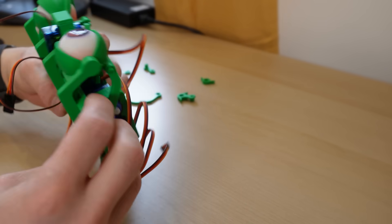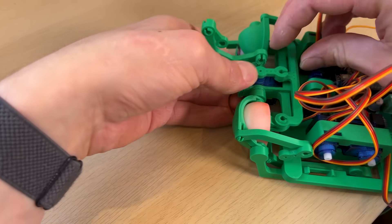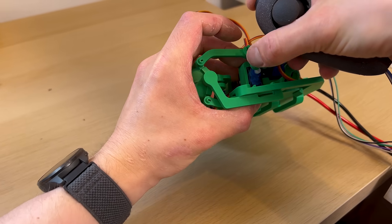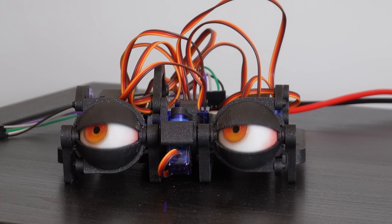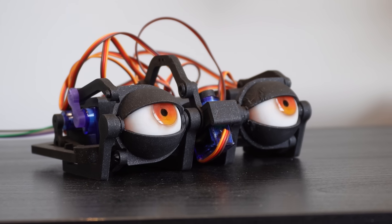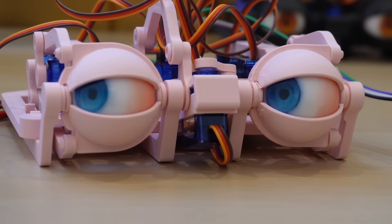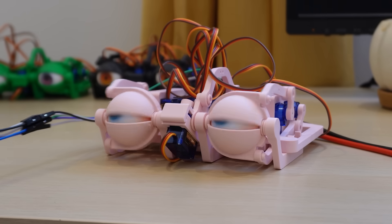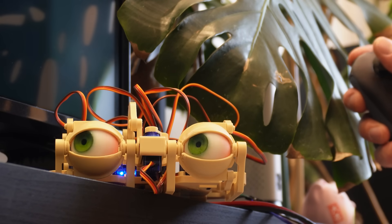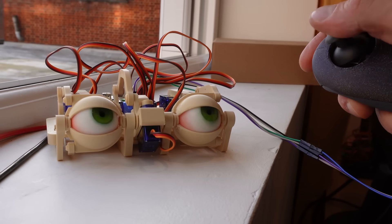So which filaments work best for this design? Initially I was quite sceptical this would work at all in PLA, so I decided to test out the design with a few different filaments: Bambu Lab's basic PLA, E-Sun's upgraded matte PLA, Prusa's Galaxy Black PLA, and some Bambu ABS. The Bambu PLA worked out really well — none of the snap-fits were too brittle or too stiff, and all the parts seemed well-balanced strength-wise. The Galaxy Black looked great with the metallic fillers hiding the layer lines, but it was a little too hard and brittle for all snap-fits to work reliably — two of the latches broke on the way in and had to be reprinted, and it was also a bit squeaky. The E-Sun upgraded matte PLA is a favourite of mine because it has such a lovely finish and just feels good. Nothing broke, but some parts were flexing a lot — after assembly though, this one worked out really nice too. Finally, the ABS predictably worked great — it's really low friction, which I love, and more flexible, meaning the snap-fits were a lot easier to snap on. However, I did find that the servo horns were a little loose and slipping, probably because the part was a little too flexible.